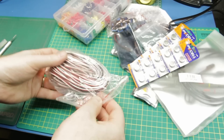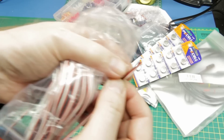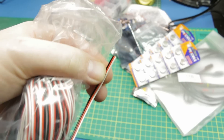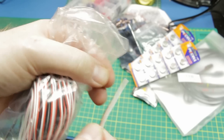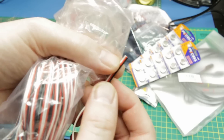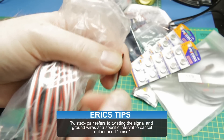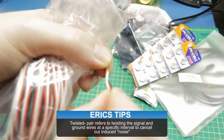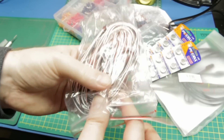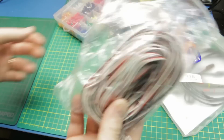Servo wire - this is just simple three-conductor stranded wire joined together in a three-conductor fashion, most commonly used on RC aircraft and everything else that uses servos. These are also fantastic for robotics or Arduino projects when you have V-Ref, ground, and a signal. The only thing that's not so great is it's not easy to effectively twisted-pair this, though you can twist it and it will work. A whole long length of it is handy to have - I was nearly out and need to run some sensor wires on the robot project.